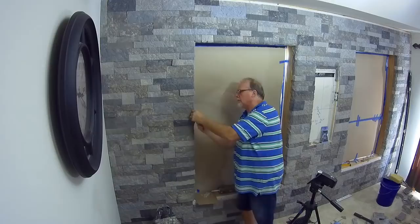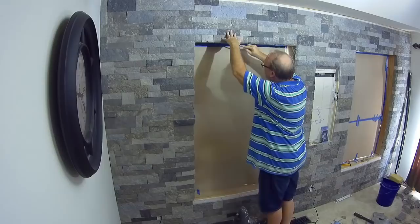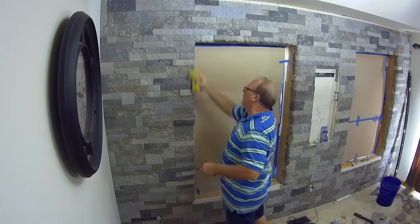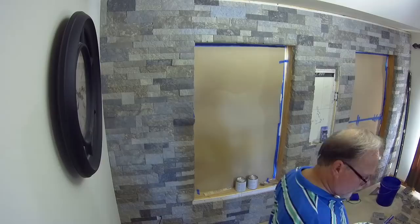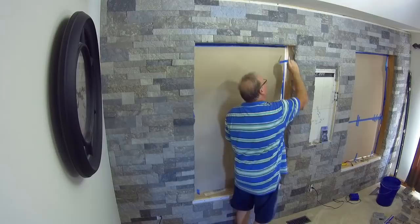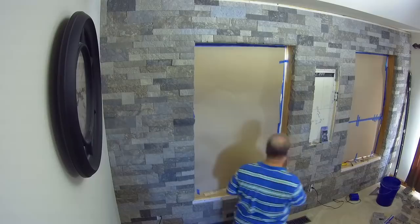The color on these stones is fairly thin on the surface, so scraping exposes uncolored substrate. What I did is go to the store and get two cans of flat latex paint — one matching the darkest stone on the wall, the other matching the lightest — then I simply used a small brush and blended the two colors together as needed around the windows wherever there was uncolored stone showing through. I just used the flat latex to blend it in and make it disappear, and it worked out perfectly.